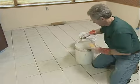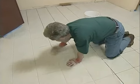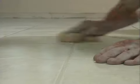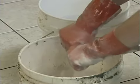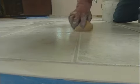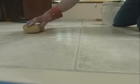Now the next step is to take a damp sponge and wipe down the surface. Rub the sponge in big circles and keep rinsing it off as it gets clogged up with the grout. And as you're cleaning the surface, you can also use a sponge to shape the grout in the joints. Rub the sponge back and forth a little and smooth the grout out. You want to end up with the grout smoothed down in the middle of the joint, just a little lower than the surface of the tile.